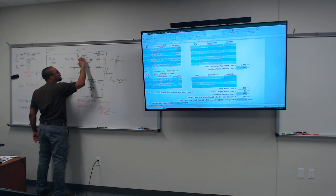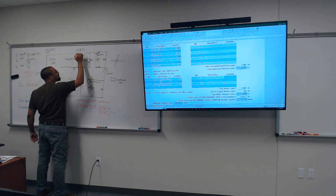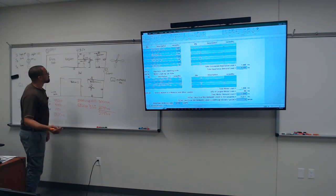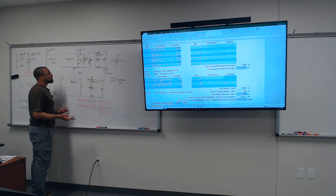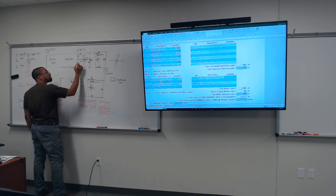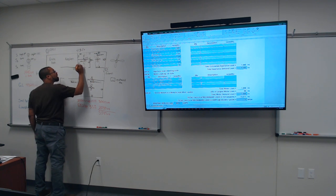Let me erase this bath board so I can have some more room. All right, bath. Okay, light. Single pole switch, single pole switch. One for the fan, one for the light. Okay. All right. Exhaust fan in the laundry, yes, because when the dryer runs, it's just gonna get humid in there, right? So you wanna put an exhaust fan in here. All right, let's put the exhaust fan right here by the 240 dryer.